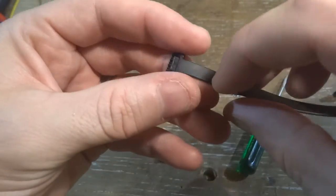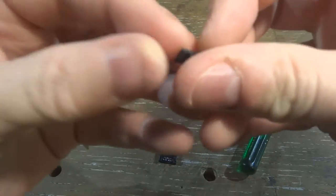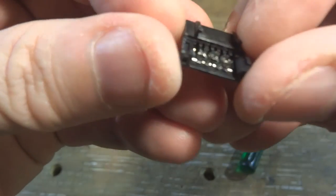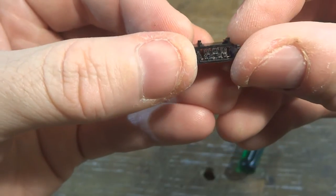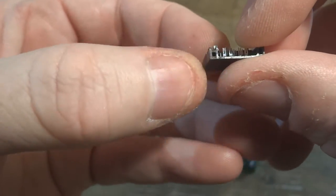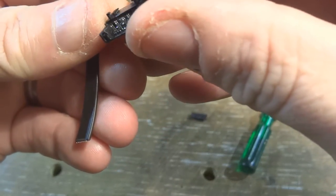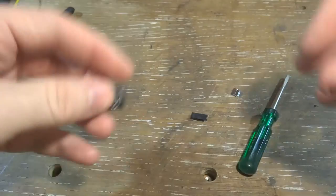Now that it's come apart, you have this section — you can simply pull it out because nothing is holding the cable back. You have the piece with the grooves, and then the more important thing where the connections are actually made. You can see these sharp pins that, when you join the cable and push it firmly together in the vise, will penetrate the cable and connect to each wire. Let me count — it's eight pins, but the two middle ones are joined together because it's one common ground wire.